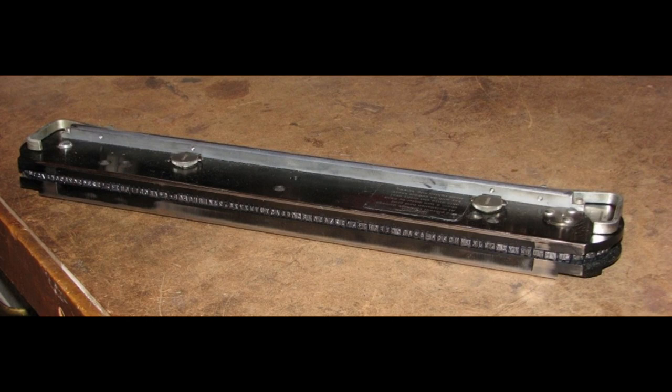This is a typical cartridge. The production models were a hair bit different, but basically the same thing. They're driven on one end by a motor, and there is a band that holds all the type together. The type are clamped onto the band with a couple of screws. There are two type per slug. The slug is, as I say, clamped onto the band. They butt each other, so the distances between all the type are the same all the way around.